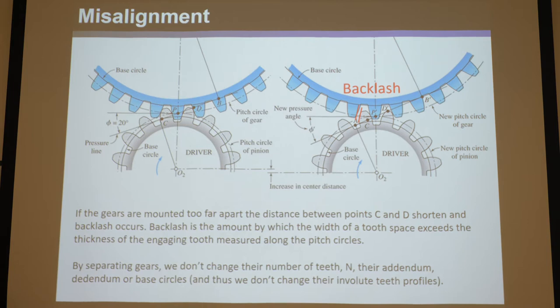That's what backlash is — slop in the gear set. You want immediate response in either direction of input at the output. Backlash occurs in gears that aren't perfectly mounted. Of course, if you mount them too close you won't get backlash, but you'll get jamming and friction. If backlash is a major concern, you may prefer to err slightly too close.